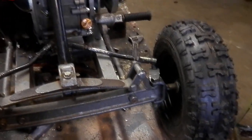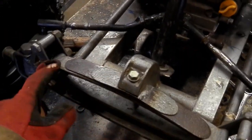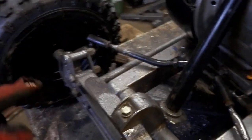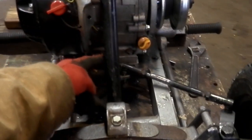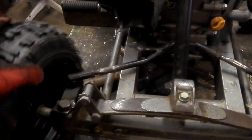I'm probably going to use that V-twin for a different project, but I've got to get more parts for that, so saving up parts for that. I'm going to use this front end — I modified it a little bit. I added a leaf because this one on here was kind of saggy. It's pretty stiff now, but it still lets it rock back and forth. I played around with the tie rods here a little bit. These arms used to be facing in that way, and the wheels wouldn't turn evenly because of the way this steering shaft is behind the front axle. Now they're at an angle, so one would turn more than the other side. By angling them out, it kind of turns it more evenly.